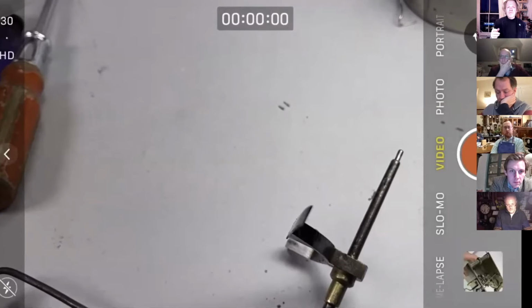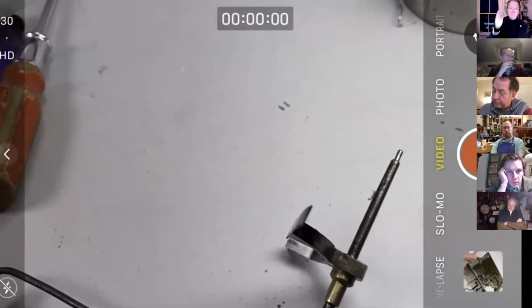And so the first thing is, can the pendulum assume a vertical position? Often on a long case clock, the top block of the suspension is square, sitting in a square hole, and that is bonkers because the chance of it hanging vertically is incredibly slim. So the top block of the suspension wants to be curved. Again, if you look on the Facebook group this week, I made one with a little round thing on the top. So the suspension hangs straight.